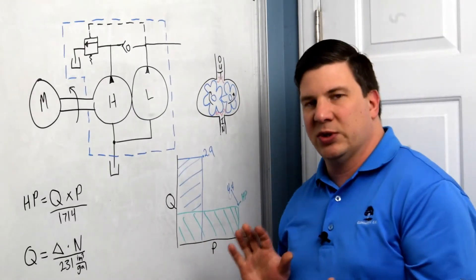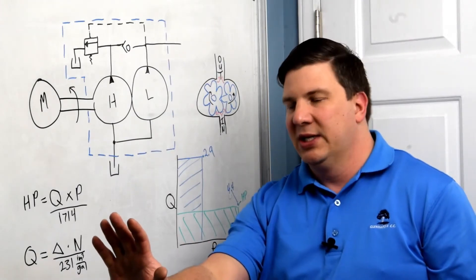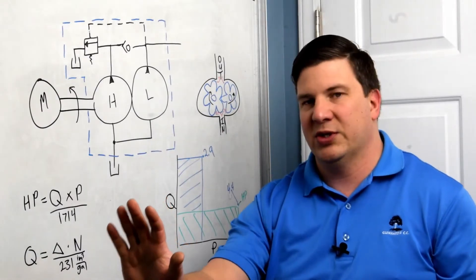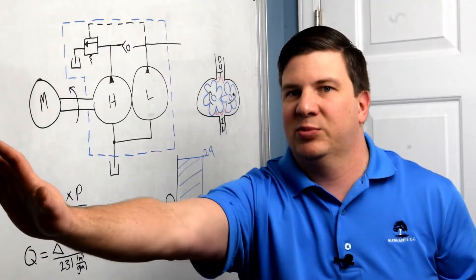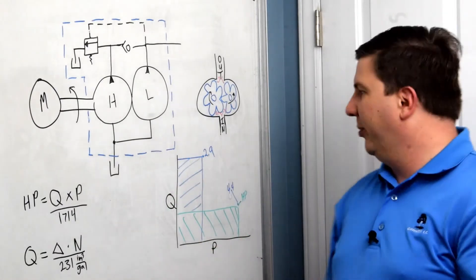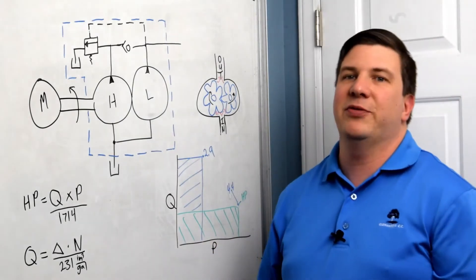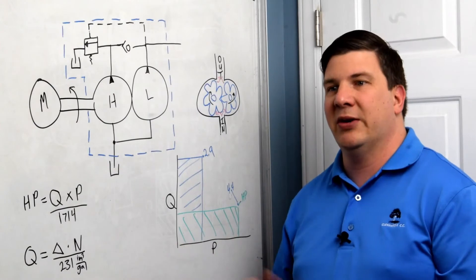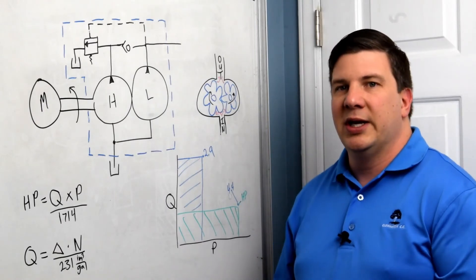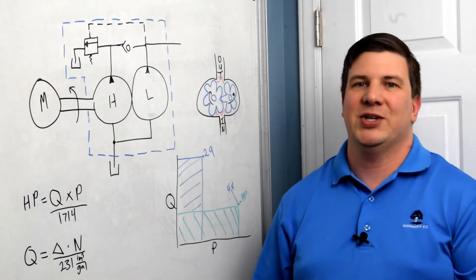What this allows us to do is: while splitting, we go really fast up into the workpiece, and then when we need that high pressure it slows down to about a fourth of the speed, breaks the log at high pressure, and as soon as it's broken it goes fast again. That's what we're accomplishing by adding a second section to our pressure and flow chart. Thank you for joining us today. We hope it was informative and that you now feel confident talking about pumps — understanding how displacement affects how much horsepower is required for your application. Thank you for watching and have a wonderful day.